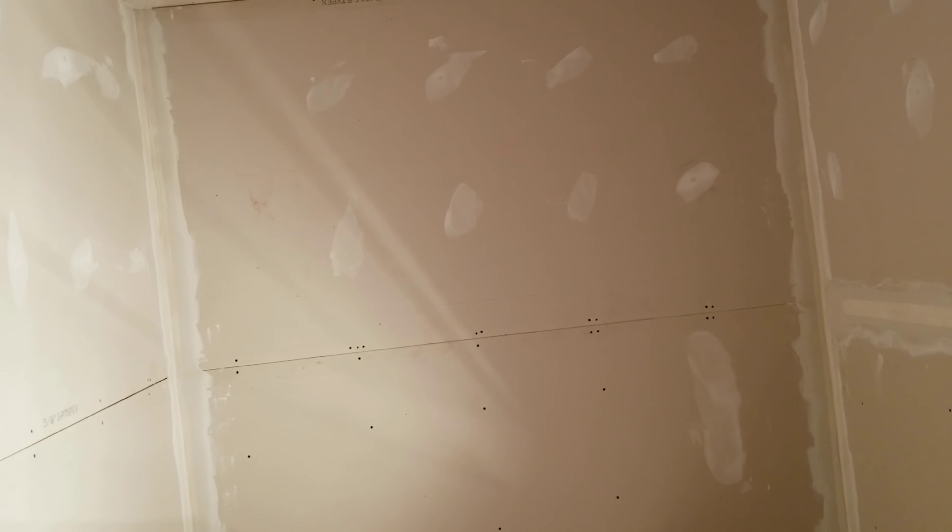We're coming together here. I got to finish up that strip over there, finish up this strip over here, and then finish up the actual ceiling — then we should be pretty much done. If I can tackle this early in the morning and get the rest done, then probably by the afternoon the mud will be dry — this stuff dries actually pretty quick. Maybe in the afternoon I'll check it, make sure it's completely dry, and if it is, I'll go ahead and do the second coat, which is going to be the feather coat — so I can feather over a little bit wider.